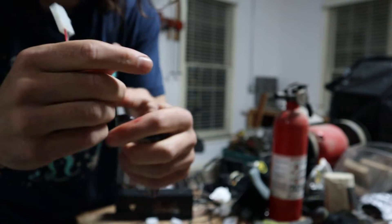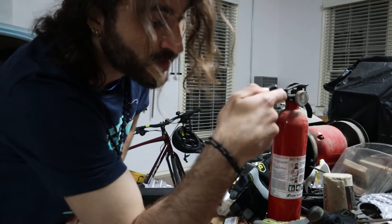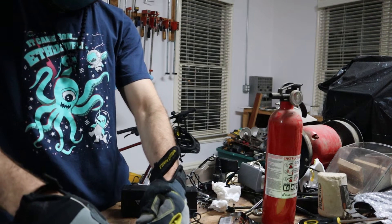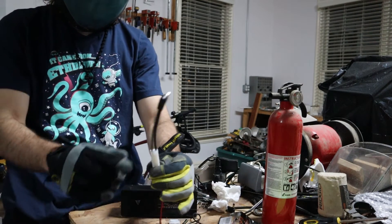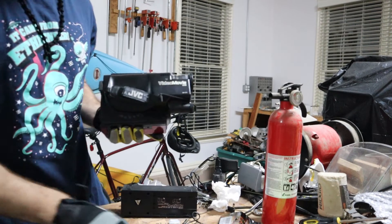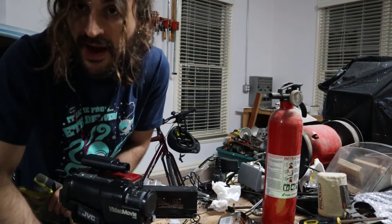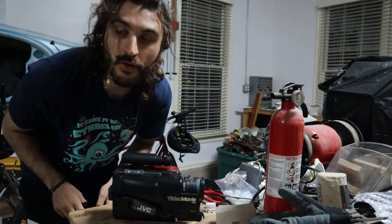It lines up with our battery here — red is positive, striped or black is negative. It's reading 11 volts, but on the battery it says 9.6 volts. Negative on negative, positive on positive. So it's connected and it hasn't blown up. Time to test the camera. This only requires 9.6 volts, but I'm getting a reading of 11 volts coming out of the battery pack. I don't have a buck converter — if you have more volts in your battery pack, you need a buck converter that converts DC energy from a high voltage to a low voltage. It's either going to blow up or it's going to work.